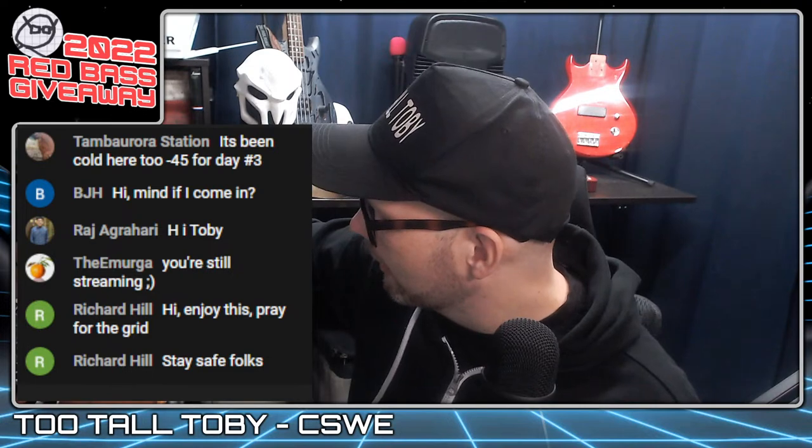What does that actually mean? Are you measuring it to the front of the fret? Are you measuring it to the back of the fret? Are you measuring it to the center of the fret? I don't know the answer, but what I do know is that I went through that fret calculator and measured every single fret all the way down along the neck, and they all matched up. So the image being inconsistent with those fret locations, I think we just have to chalk that up to the image being distorted.